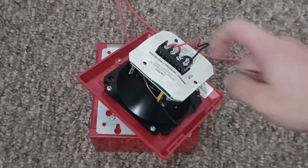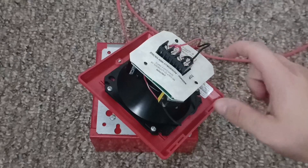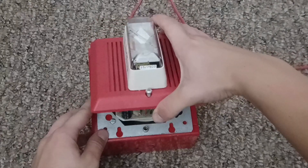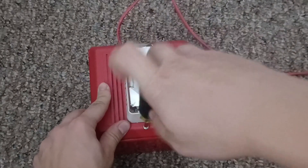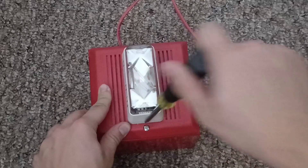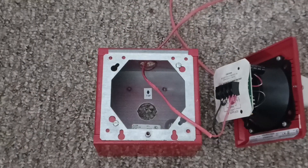I put the positive here and the negative there to demonstrate what to do with a four-wire horn strobe if you want to put it into two-wire configuration. If you want four-wire, you need to put another positive there and another negative there — two positives on this side and two negatives here. To mount your Integrity, you put it in top first and then bottom in, and then screw it in. The model of this back box is a 757A-SB service mount back box.